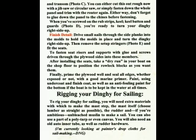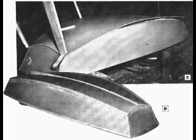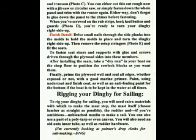To mark the shape of the bottom plank, clamp and brace the plywood over the framework and pencil along the chines, bow, and transom. Photo C. You can either cut this out rough now with a jigsaw or circular saw, or simply fasten down the whole panel and trim with the router again. Either way, don't forget to glue down the panel to the chines before fastening.